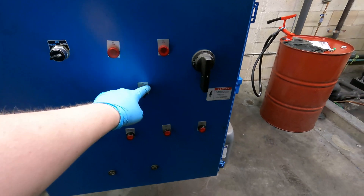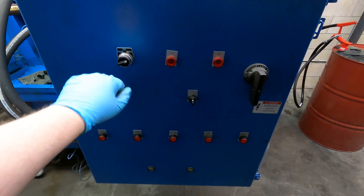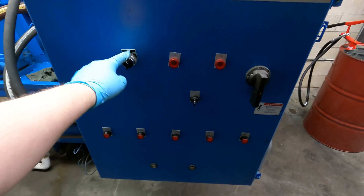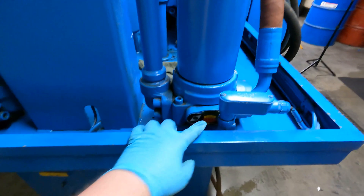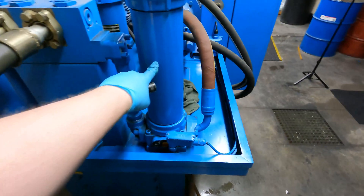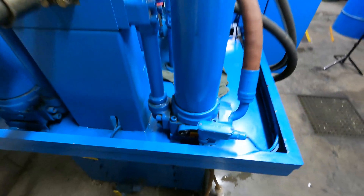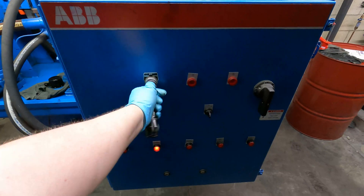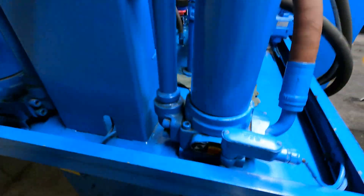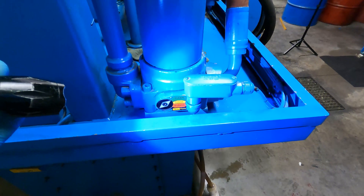The oil is just touching that high level, so I'll stop there. Looking at the panel, we have M1 and M2 — motor 1 and motor 2 — with lights for motor 1 run and motor 2 run. Right now it's in auto, switched to the right, meaning they can control it from upstairs. Moving it to hand will start up this pump. On the back of the pump there's a filter indicator: at the top it says clean, then change element, then bypass. If it was in the yellow when we start up, we'd need to change this filter. I'll put it in hand.